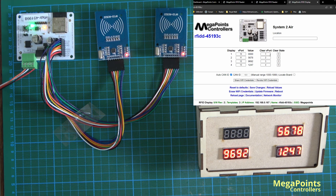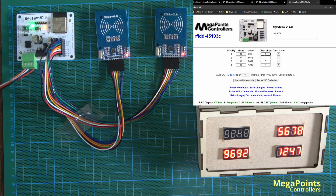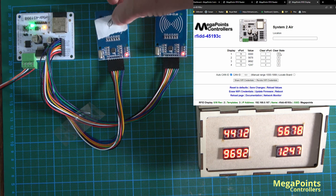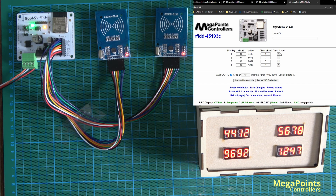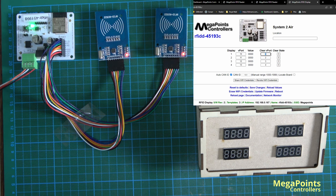Let's talk about the clear v-port feature. I've told each of these displays to listen to specific v-ports — in this case one, two, three and four. The clear state toggles between zero and one: one is occupied, zero is cleared. So if a v-port such as a block detector or point position indicator triggers and the state is set to one, it will clear the display. You can also manually clear displays using, for example, a panel controller configured on those v-ports.